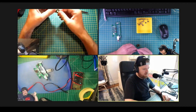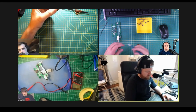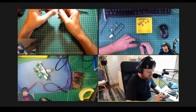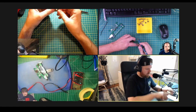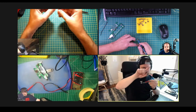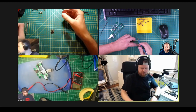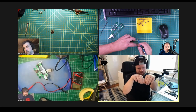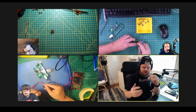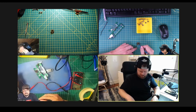It's not a transformer like a balun or something, because that's where it's important that you have the correct direction and this and that. The thing with the direction is if they are in the same direction, their flux lines are the same. If you're looking at it this way, the flux goes around by the right hand rule this way and this one goes this way, but since their fields are kind of coming up above the board, they don't really interact and intertwine a lot. When you have these toroids flat up against each other, like two pancakes, instead of like this, that's when their field lines really interact.